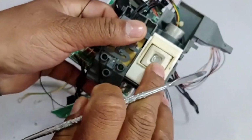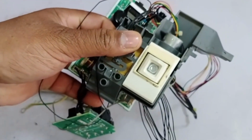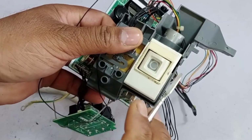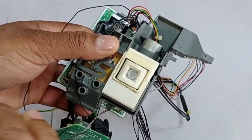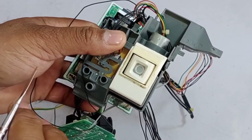After this, let me explain that here you can see some motors attached, and there's an eye sensor. This sensor is a motion detector. If there aren't many people moving in the room, the sensor detects this and slows down the cooling due to the room being empty. This helps save energy by adjusting the system's performance based on the room's occupancy. However, if there are more people in the room, the sensor will operate according to that. This is a very useful function.